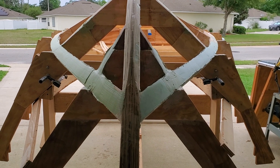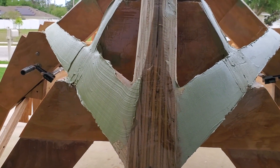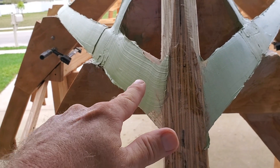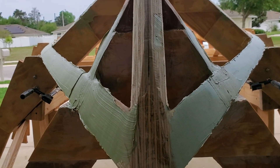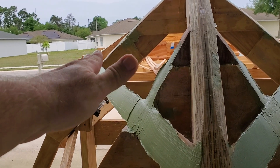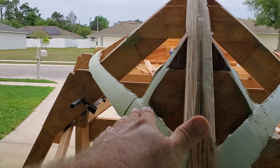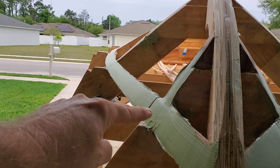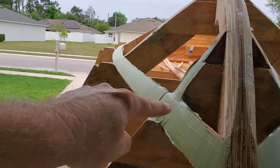Right now this is good because I've filled it in with marine fairing epoxy after I've built up with two — actually three layers of wood here, two back there, same thing on this side. What had happened is I obviously underestimated the amount of twist that needed to come in when it was going towards the stem, and it left it relatively flat at this level. Picture a piece of plywood trying to rest upon here — it needs to be touching everywhere, not have a huge hole like there would have been.